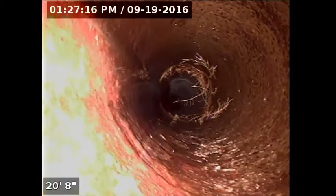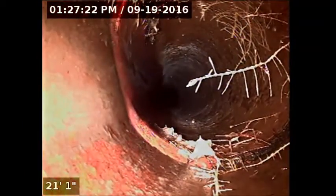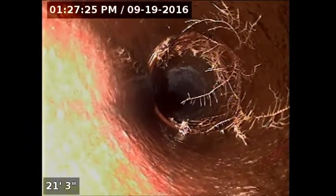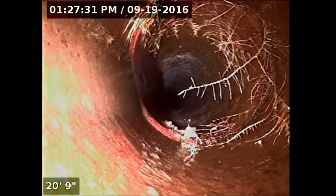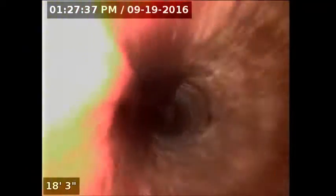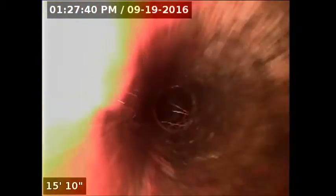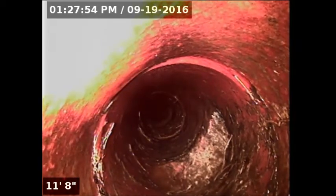This is the area that was pretty bad that was marked on the side of the house — that's after rootering. That's where I thought your biggest problem was until I saw what was out at the street. This all cleaned up pretty good; it was pretty packed with roots. That's just a joint where either there's a test tee or a line coming in from the side, tying in.